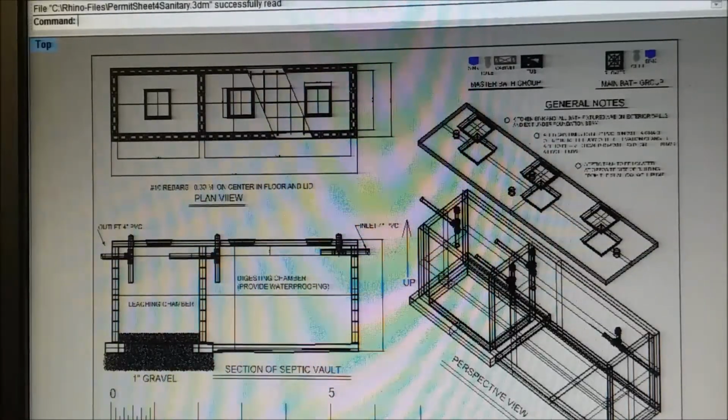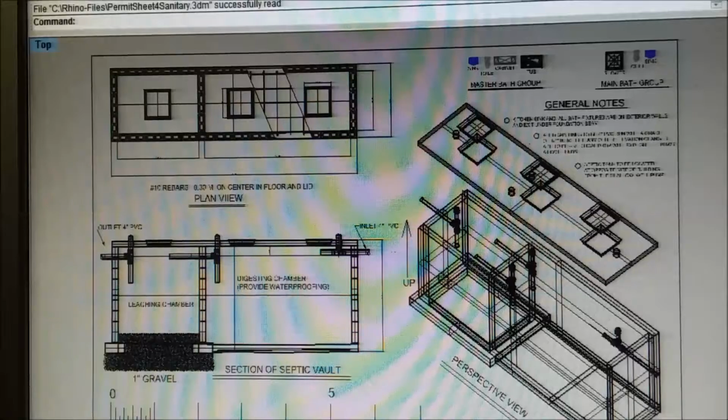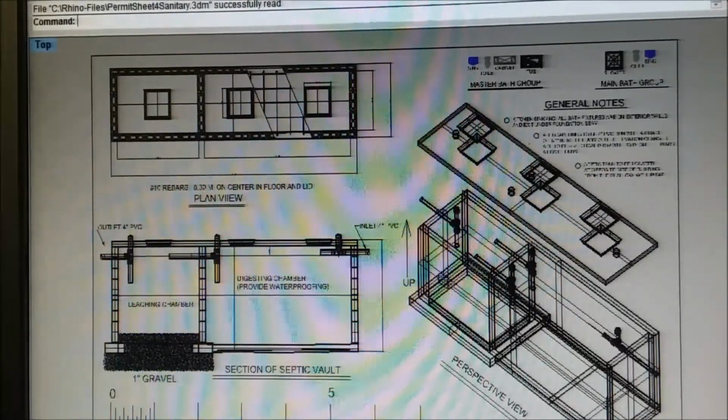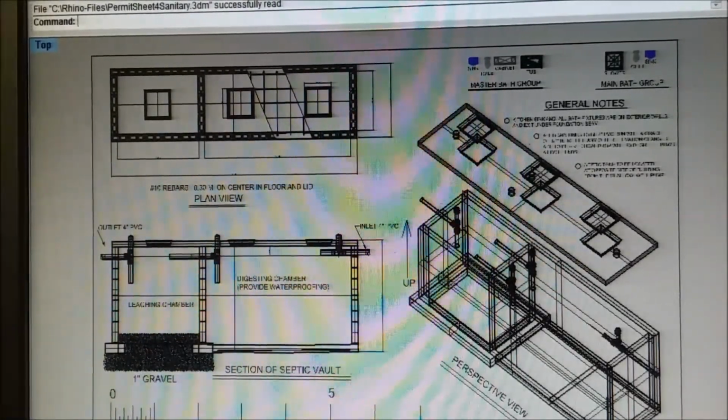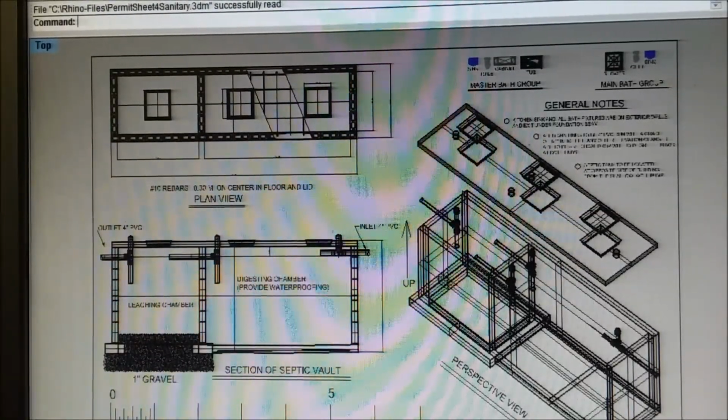1 part in 48. It's simple. But that works. The water doesn't outrun the poo, and it doesn't go so slow that everything settles out and just sits in the pipe and the water slowly drains away. It's worked over hundreds of years. It's still the right number. Anyway, it comes in, got to fall into air.